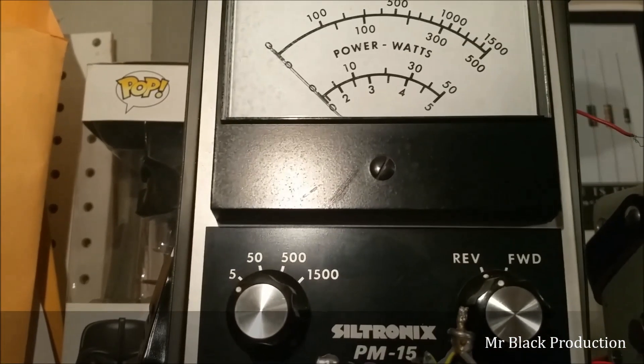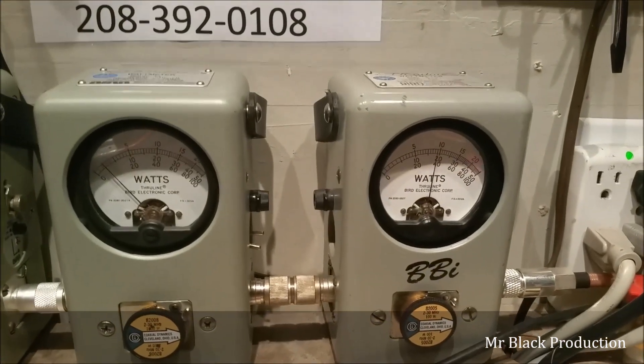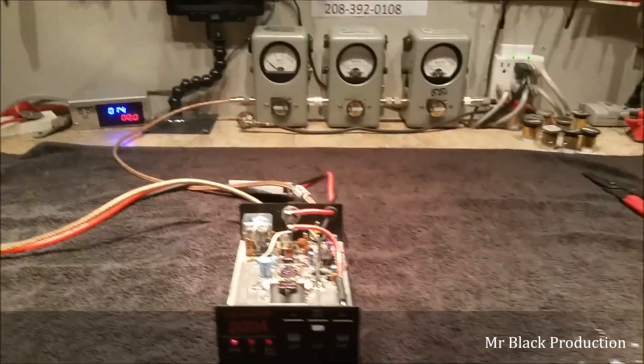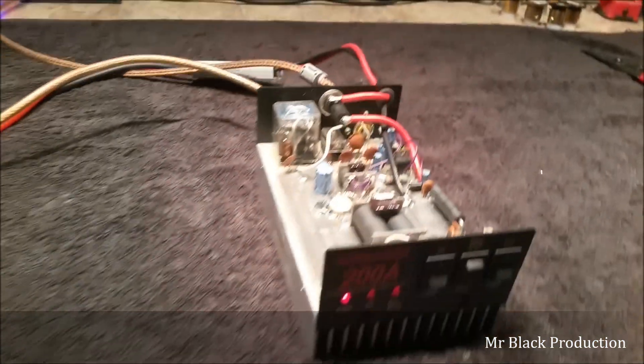So we're going to put barely 30 watts into it. Here's a standing wave going through the box. Radio doesn't even know it's there. Of course we're going into the Bird 10,000-watt dummy load as always. We'll start out on low — a 2-watt dead key gets you about a 100-watt carrier, starting at about 200. That's your input tune going into it. Put it up on high — 240 watts. 240 watts on high.